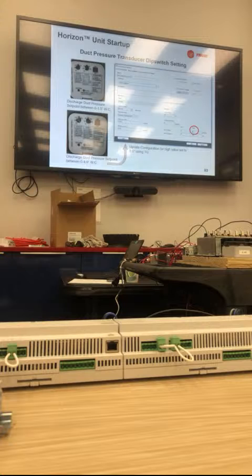And there are a few other diagnostics, in case it's not reading quite right, with some checks to make sure the transducer is reading correctly. Because we've had issues with blown ductwork if the high static pressure switch isn't added into the safety circuit of the unit.